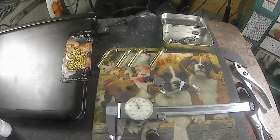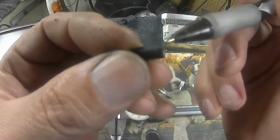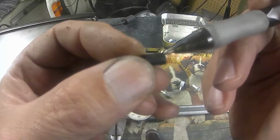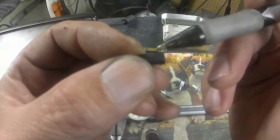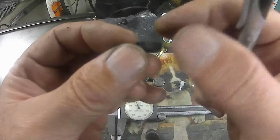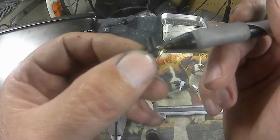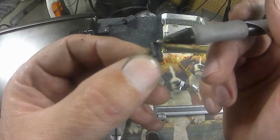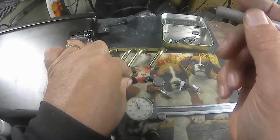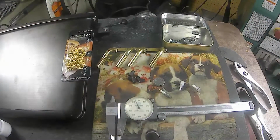because I wanted to take right out on the end here to put a collar around it. So I would put another diameter in here that's just a little bit bigger, and that way it would have a collar of thicker material around the end of it, just like the originals. I recall the originals have a collar around the end, so they're this diameter and then it's a little bit bigger. I might just fiddle around with the mold tonight and see what I can come up with.